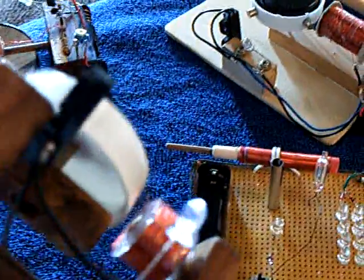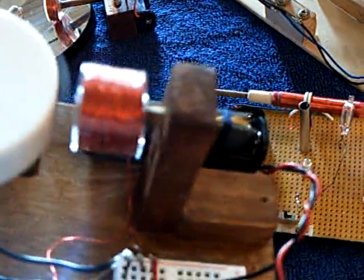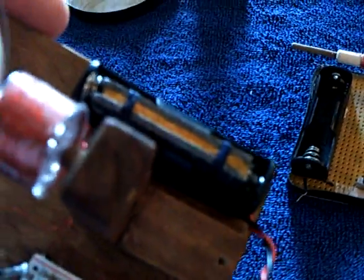This is the little capacitor motor that I use for testing. It's pretty simple — it's got one bearing that the rotor sits on, four magnets, a reed switch, and an LED that's being fired on the flyback of that coil. The power source now is that little homemade AA rechargeable battery. This runs for about an hour on that thing.